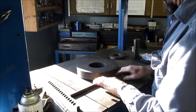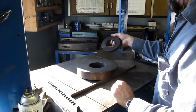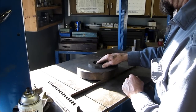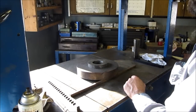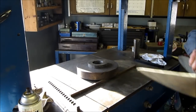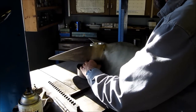We're pushing basically in the center here and the width is supporting it — it always works out fine. Now we want to choke in close to our diameter of our prop, but leave room for the broach to travel. We have several different rings we put up here for different diameters. We put up a prop here with the small end of the bore down at the bottom.